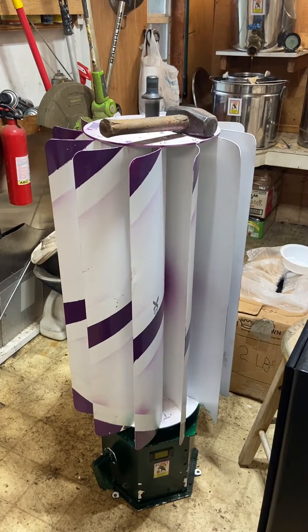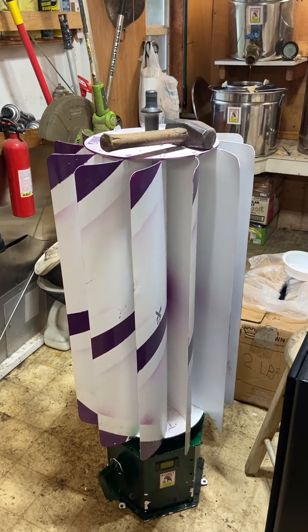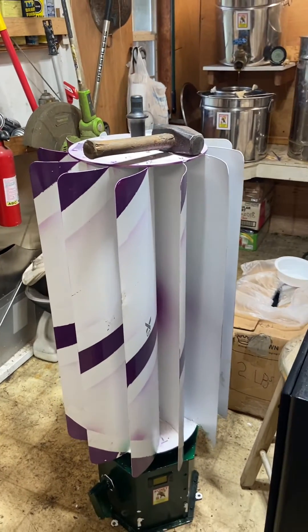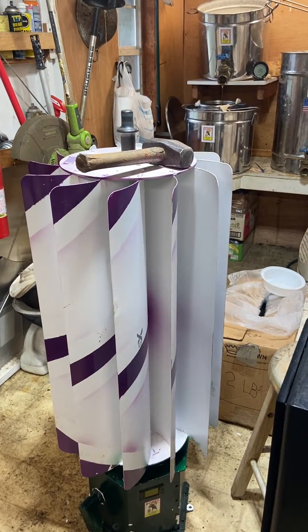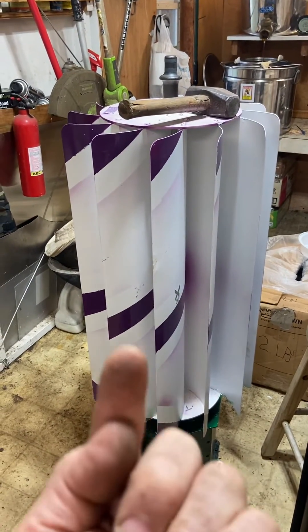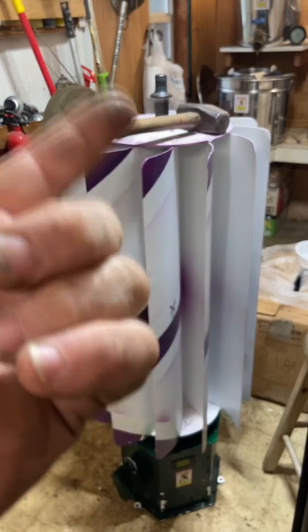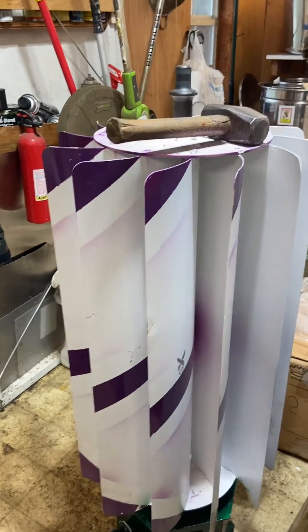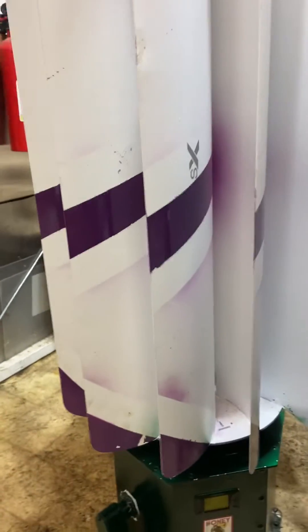As you can see from what's in the picture, the tolerance is so tight it's incredible. So I made sure I miked it. The shaft is just the right size — just under two inches for the cavity that's in the bottom part. And a half-inch rod is of course going up through there — milled for it. So extremely tight. I have zero tolerance.